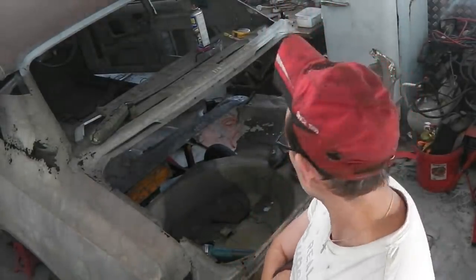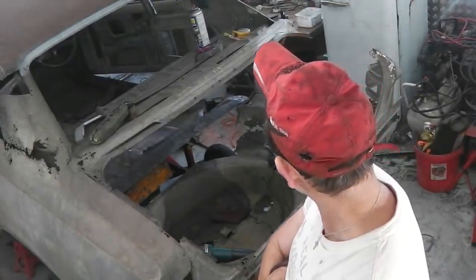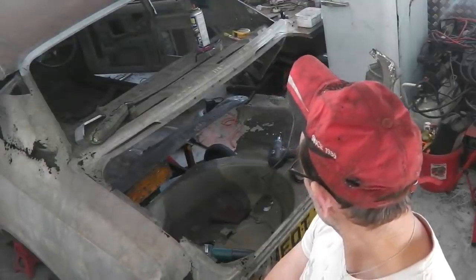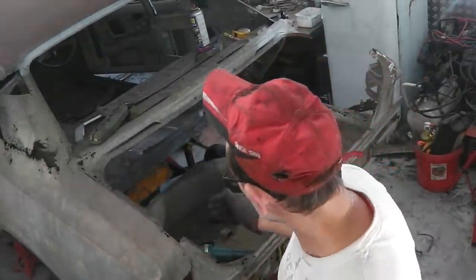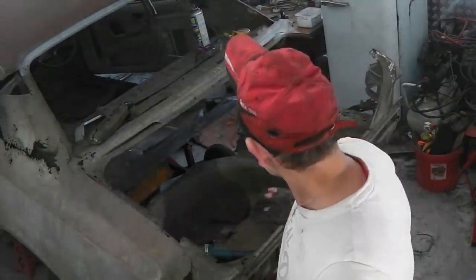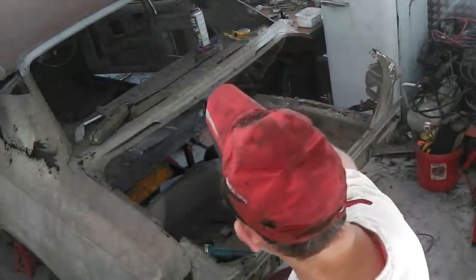I'll tell you why. There's so many spot welds. Hundreds of them on them chassis legs. So the chassis legs and this boot floor are the hardest. Now the boot floor's in the way, so I'm going to slice it off, but I'm going to leave this side of the boot floor and this quarter wing on. By removing this, I can get in and do this repair.